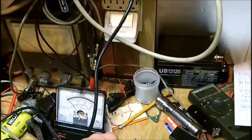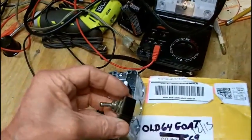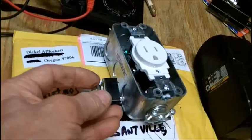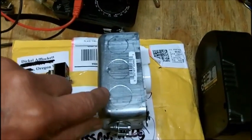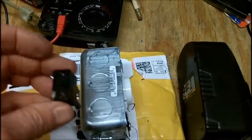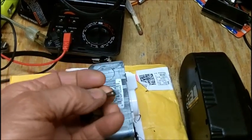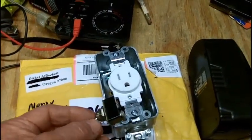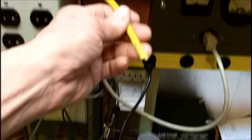What I'm going to try to do for a shunt on the bulb, I'm going to try to mount a toggle switch. I think I can probably get it down on the side over here, like this. On the inside, I think there's enough room. So what I got to do is drill a hole in here. And that's going to be hard because of how these outlets' knockouts are made — the part that holds the knockout is right here. So in reality, I need to drill very close to that, the diameter of this threaded part, to go through, because it needs to be down in this area. So it'll sit down in here. It's the smallest toggle that I've got that'll handle 120 volts.